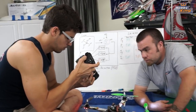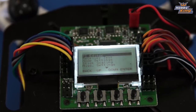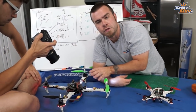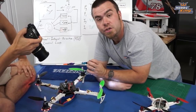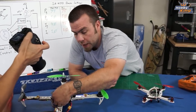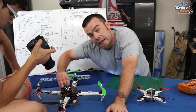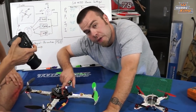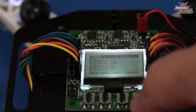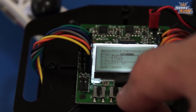As soon as I get some position lock — this assumes we've already gone in, loaded the X-copter settings, and calibrated the accelerometers — the next thing we're going to do is go into the PI editor and plug in the numbers I've come up with for the SK 450. Go to PI editor, it's the first option in the menu, hit enter, and you'll see it loads up. Just like with the dead cat, the roll and pitch settings are linked so we're not going to unlink those. First, go down to P gain, hit the change button, and change that to a value of 75.